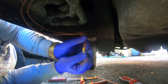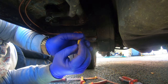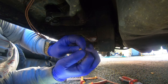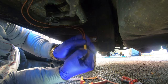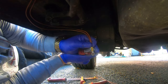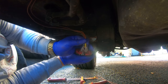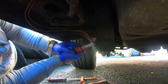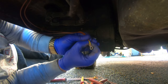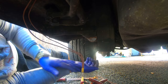I'm going to put that into the eye crimp like so. Make sure that both conductors are sitting flat if you can. I can't see what I'm doing — I bet you can see perfectly from the camera but I can't see anything. I think it's in. I'm just going to use the pliers for a second to give it a little push down and a good squeeze. That's holding it a bit flatter.